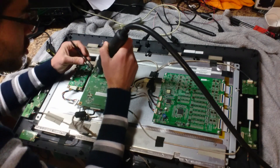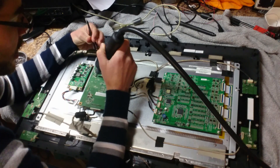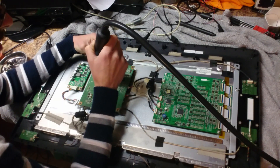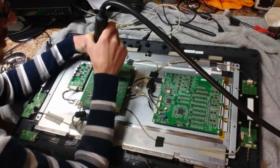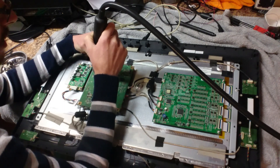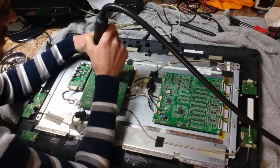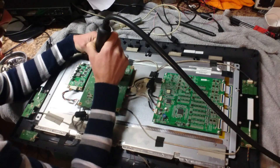When you're working on the chip, you'll see that one side — all four of the pins — are connected to the same point, and three pins on the other side are connected to the same point. There's one pin that's separated, and that one is basically the current controller pin. So the ones that are connected, you can be a little sloppy on the soldering there. Just make sure that the one pin that's separated stays separated. This one's not a particularly difficult job.